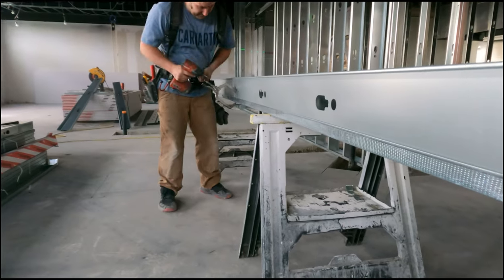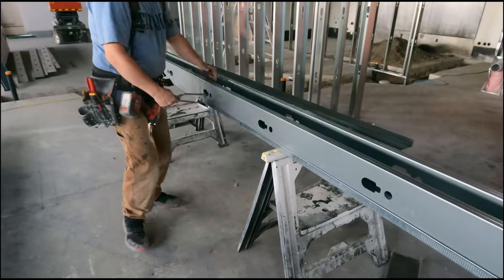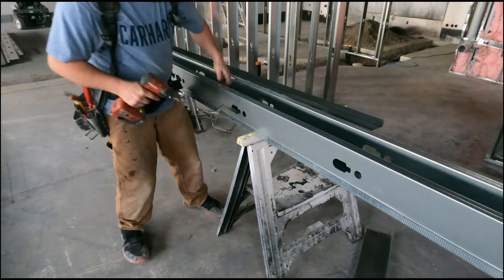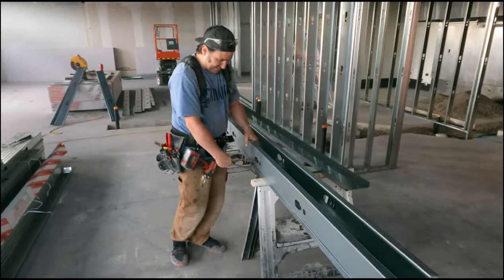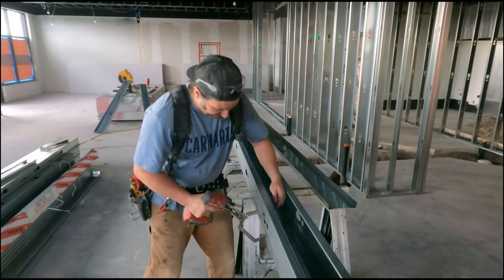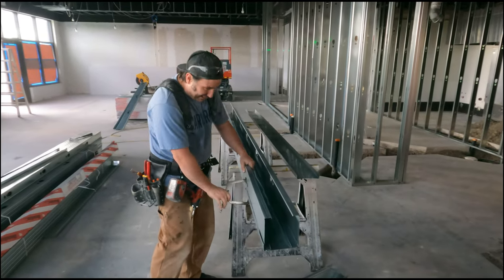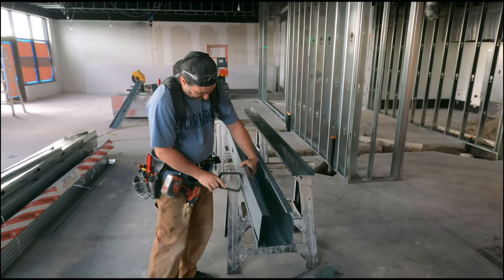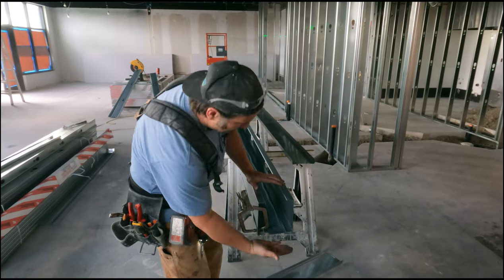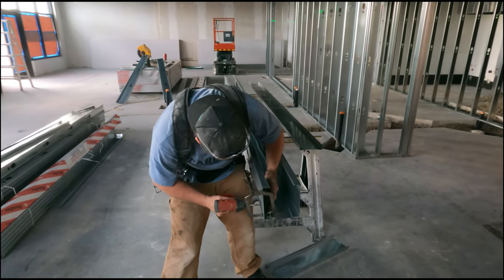Let me just look at the comment section. Well, there's a lot of different ways you can build these, do different things. Especially when it comes to the clips on the actual stud part. You can put angle, or you can put track, you can put angle on the top and bottom. You can do whatever you want, right? I'm just putting angle, especially with the light gauge. It'll sit right on top, and I'll have my track side to side. And I'll put cripples in to catch it.